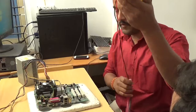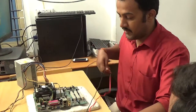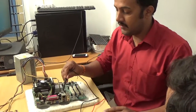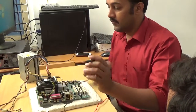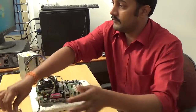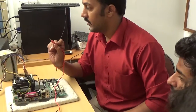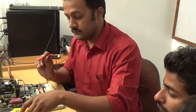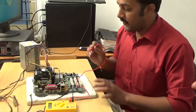Next, the black probe is connected to the ground. That means anywhere — this is also a ground point. Every time you can connect the black probe to any black wire. Always check with the red probe.